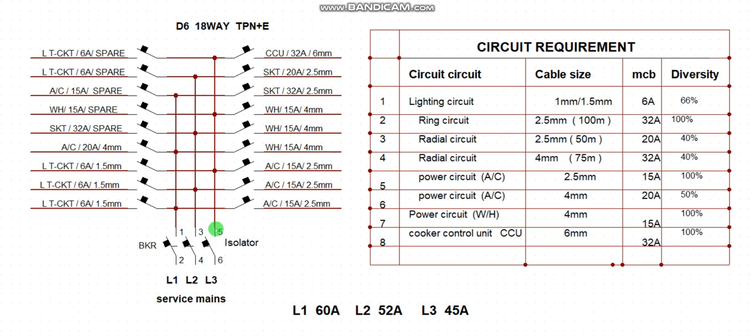What we often find on site or in domestic dwellings is that we go to the distribution board and discover that the lighting points are assigned to a particular line, perhaps line 1. We assign lighting points to line 1 and overload the other two lines by taking away load from here and sharing it to those two lines, dedicating only one for the lighting system. That is a very wrong installation and a very bad exercise. I'll do another video covering the arrangement of the distribution board when you want to incorporate a solar supply inverter system. But let us now analyze this particular one.